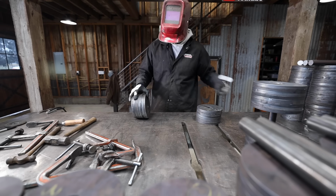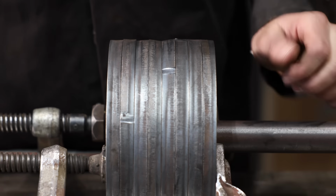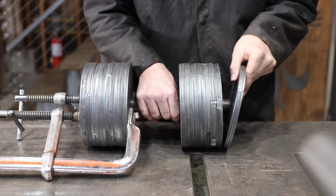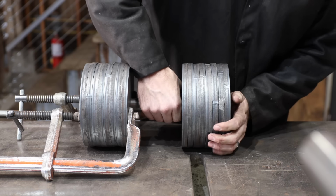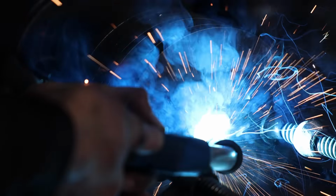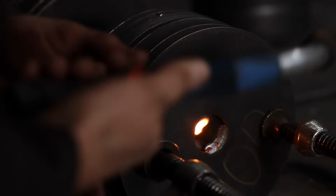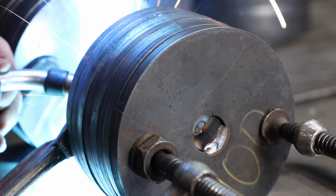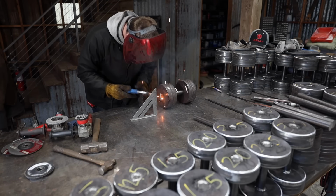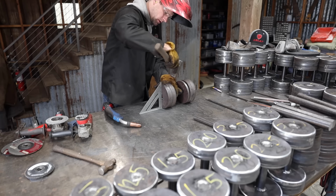I turned the bevels in on each other so it'd be more peaks and valleys instead of a Christmas tree, if that makes sense. I recessed the handle in 1/8 of an inch to minimize the amount the weld protruded on the outside. I always made sure the outside plates were perpendicular on both axes before clamping the plates tightly and welding the inside.